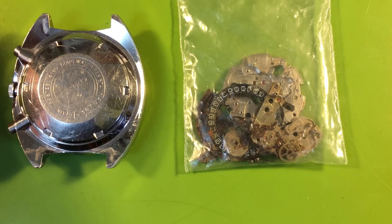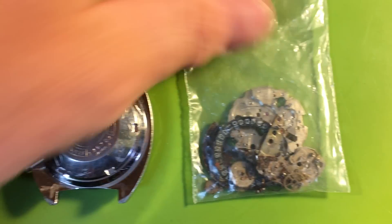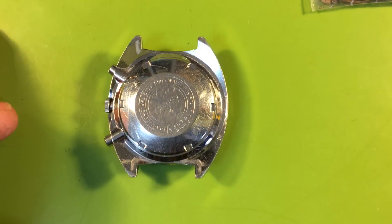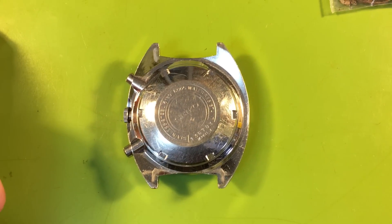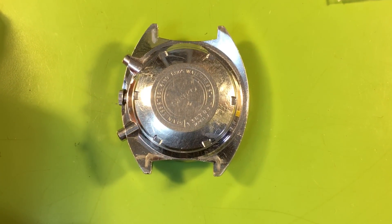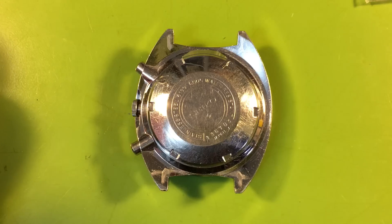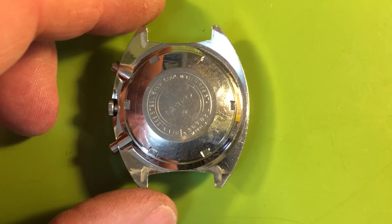Here's the remains of your old movement. The reason I did this was not only to make sure that everything was truly bad, but also because the donor you sent was a blue dial. Blue dials use the tomato red handset for the chronograph; gold dials use the crimson red handset. The chronograph hands can only be used basically once — they're mated to one chronograph wheel. That's just the way Seiko set that system up.